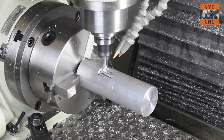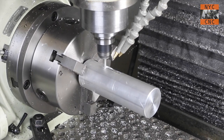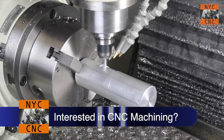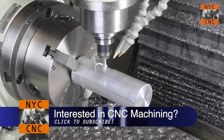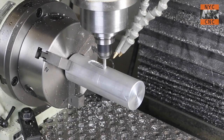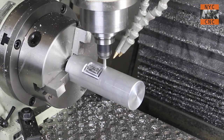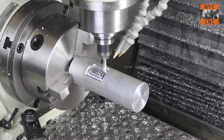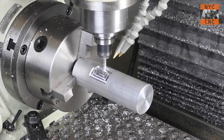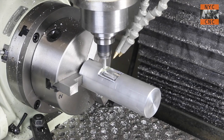This is a two-inch piece of aluminum. It ended up working great in this job even though it was only held with about half an inch of the inverse jaws. Standard jaws would provide a lot more support, as would the tailstock option that the Tormach fourth axis also sells. But as you can see here, the cutting is great.